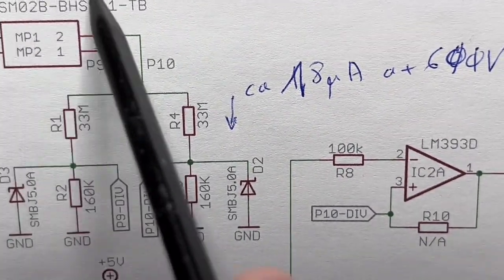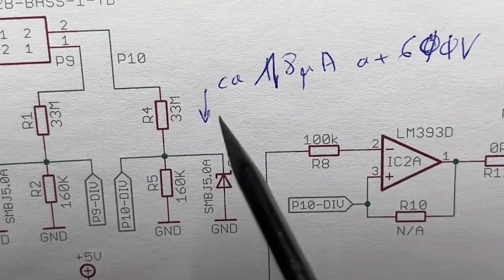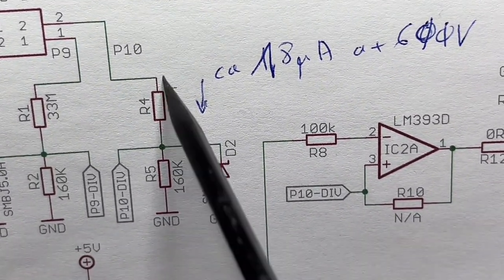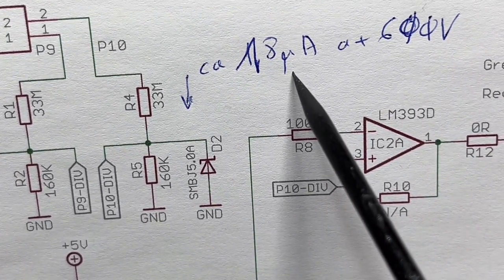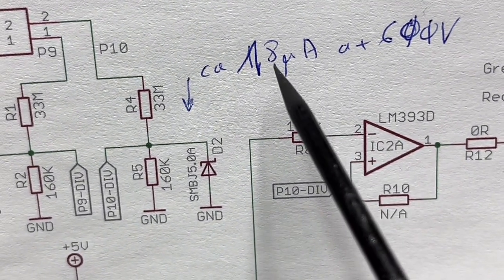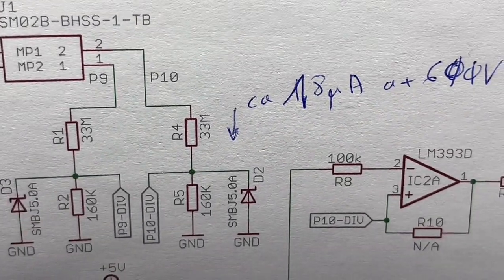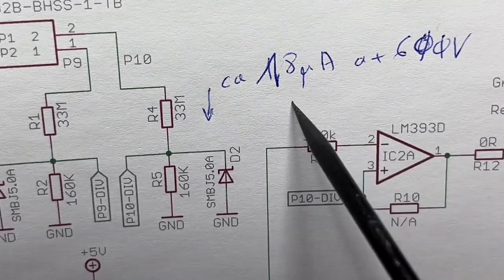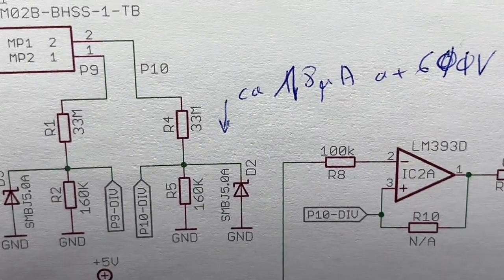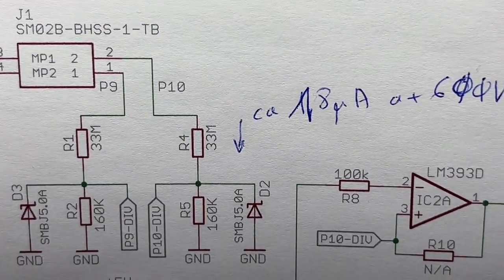The design had two goals. First: safety - this is why I used red and green LEDs and not just a red LED that is on or off, because if I lose power from this circuit I'm not seeing anything and I'd have to rely on hope. Second: not loading the measurement circuit. Even at 600 volts, this resistive divider draws only 18 microamps or less. At plus or minus 20-30 microamps on the anode or grid 2, this is nothing - it does not falsify the results.